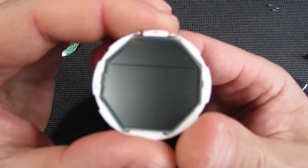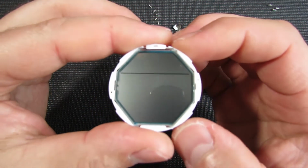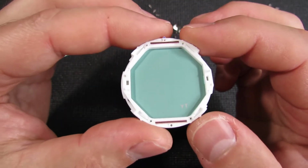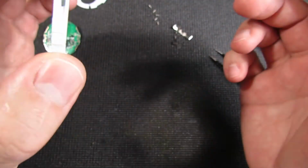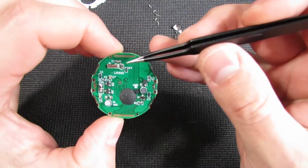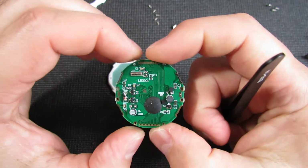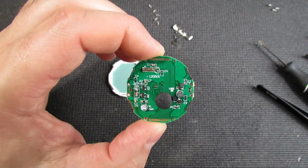Now let's see the display. Again, not in focus. Very nice. I like it. This is a fluorescent backlight plate. It's interesting. Okay, let's put back all components, put back the battery, and try to measure the frequency of the quartz, because this small component, the crystal quartz, is the main component which creates the frequency, and only this one guy makes good accuracy for the crystal watches.